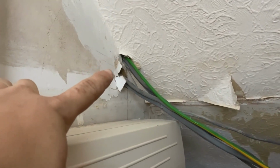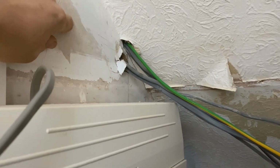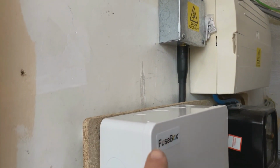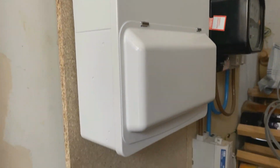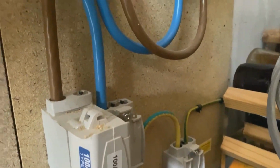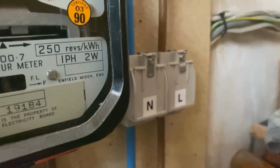They are in zone, with a light switch on the opposite side of the wall for the utility room. So we're going to trunk down, around, and then back down here into the top of the board. Well, into behind the board. So yeah, look what he's done for me as well, look. He's even put this in so I can take my tails off and take them to the new board. So I'm going to dig the laser out now, and I'm going to cut in the downlight above the island. So that is next job.